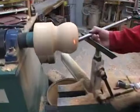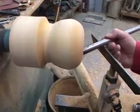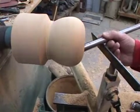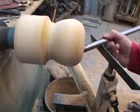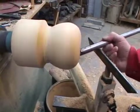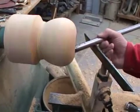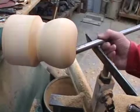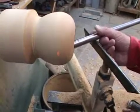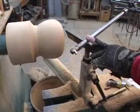and just whisk across that surface. Listen to the hiss. And look at the speed that I move across that surface, very slowly. I don't want to go fast. If I go too fast, it's going to leave some torn out stuff in there. If I go slower, it's going to leave a cleaner cut. All right? So now I've gone back and forth along that high spot. Let's double check and see how we did.